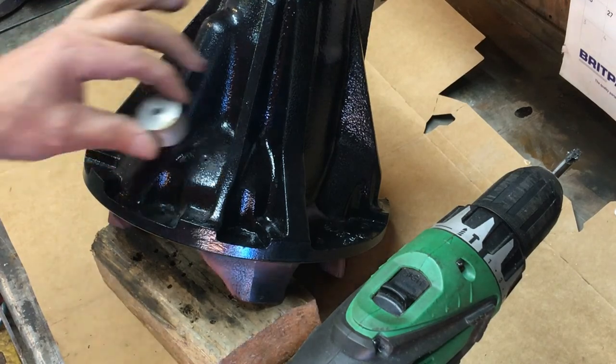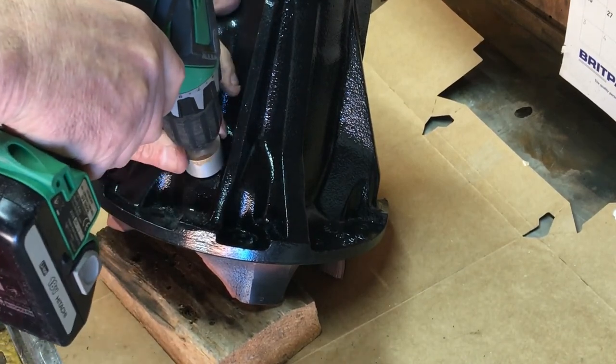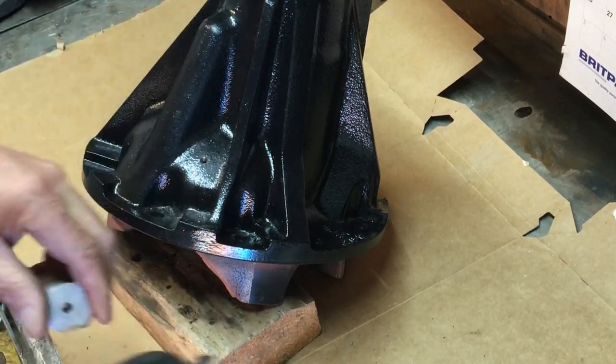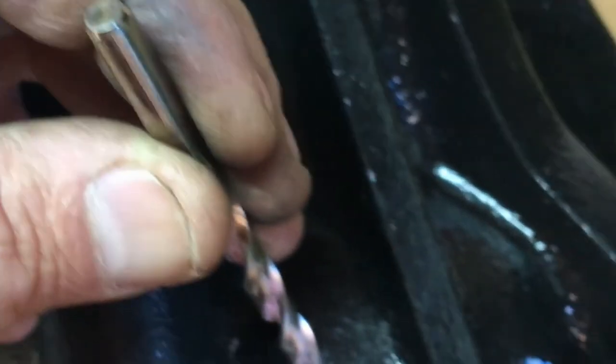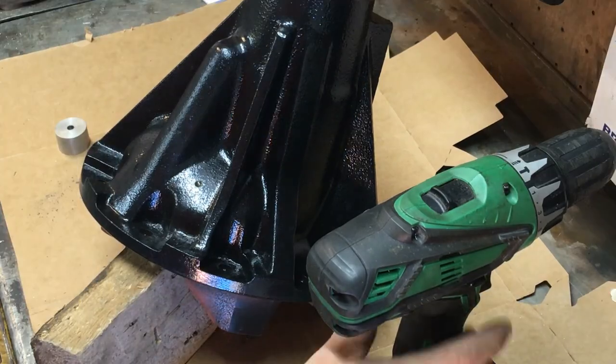I've got the diff positioned on a piece of wood. We'll put the drill in there, hold that block of aluminium square. There we go - that's what a center drill does for you: it gives you a kind of cone. When you come along with another drill, it will come in and pick up in that hole - you've got something to start that drill off. That's what center drills are for.